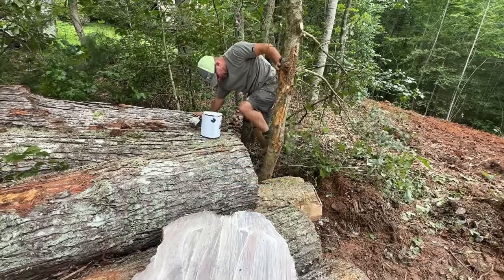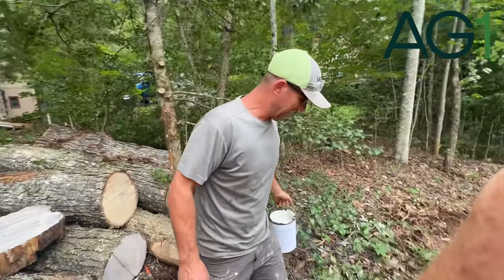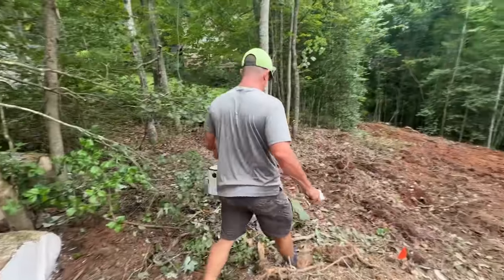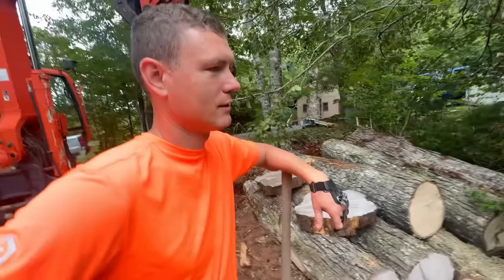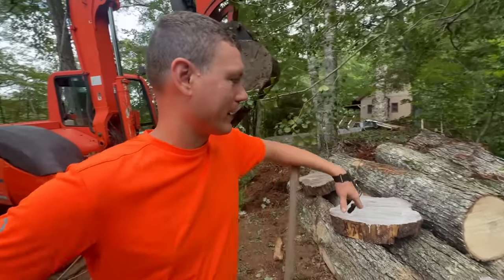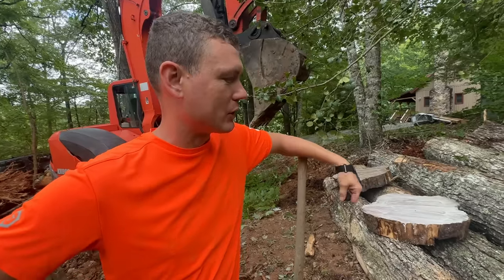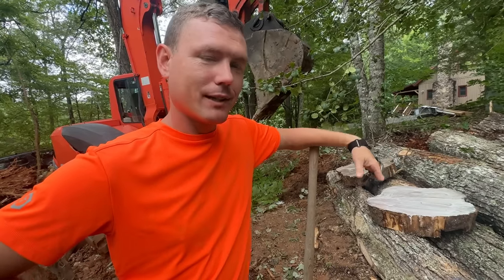We are back on site this morning, and believe it or not, Jamie found something for Jason to paint already. Yeah. But you're loving it, aren't you? Oh yeah, you know me. I start the day off right with some painting. There it is. So what's going on here? Well, you know, these are really nice, high quality logs, and you got to seal the end grain so it doesn't dry too quickly and crack and check. So I thought, why not get him to do it, you know?